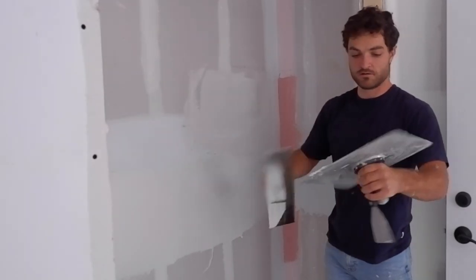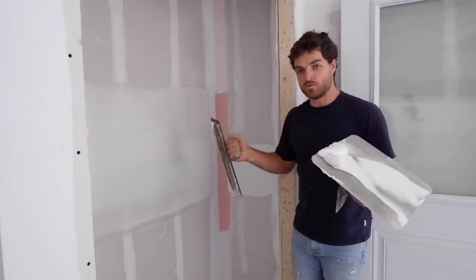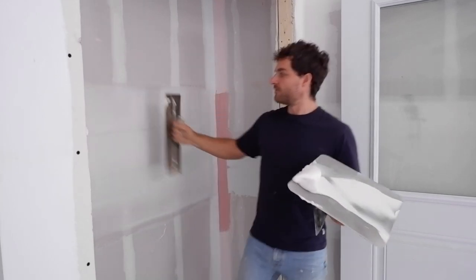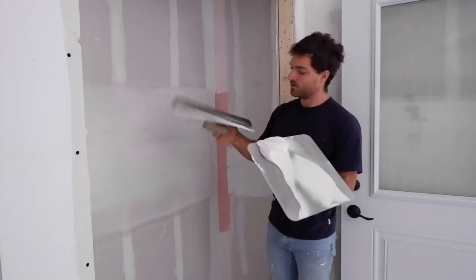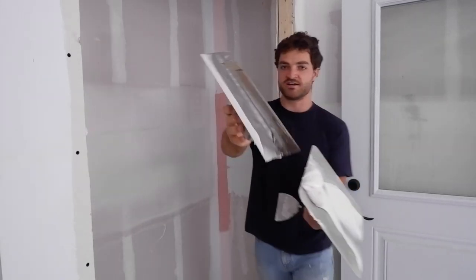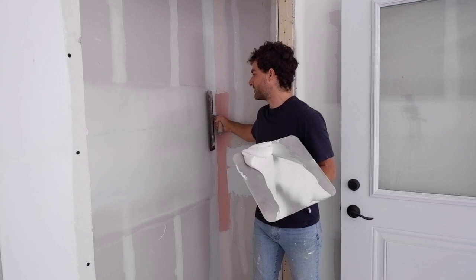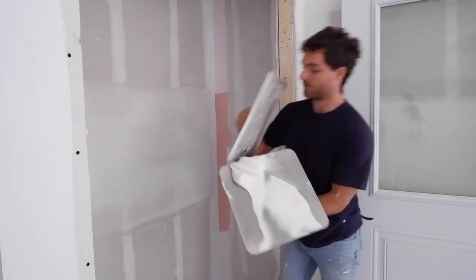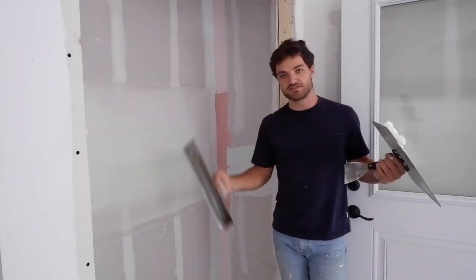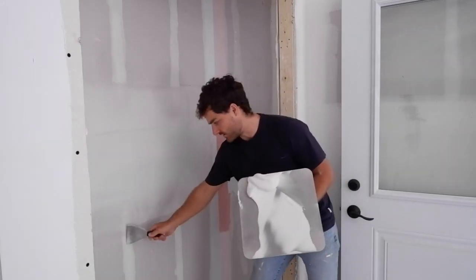We have a high spot there, so I have it on there. I'm going to do one final pass, nice and tight, from either side. You can see how much excess has come off even though it's my third time going over it. And just like that, that is our third and final coat done on the flats. You should go over it again and bring up those edges.